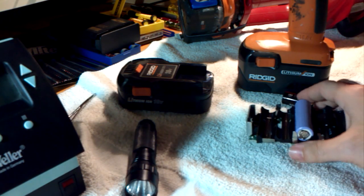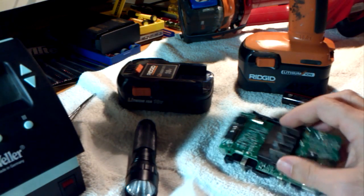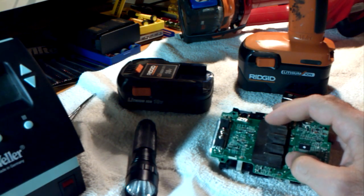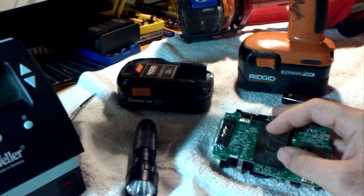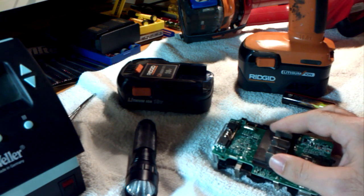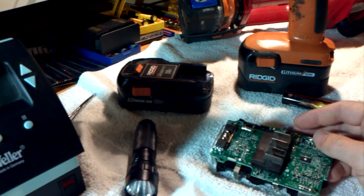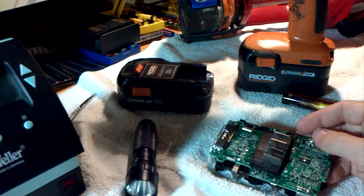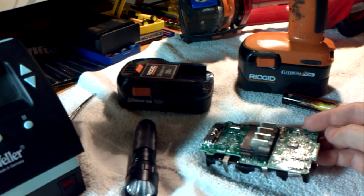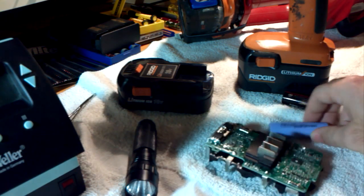We've got four connections here — two main and two auxiliary. But you'd have to have one connection per cell to fully balance it, so you'd need to add a bit more metal and connections, and there's more opportunity for stuff to go wrong. The chargers would cost a bit more, but not a whole lot. Can it be done engineering-wise? Absolutely. My rough estimate: another dollar per battery for metal and circuitry, and maybe another five dollars per charger. So it's definitely worth it — I don't know why they don't do it. I would say probably laziness.